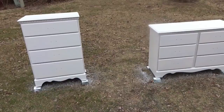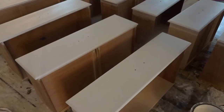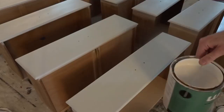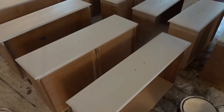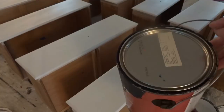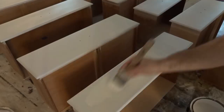Check it out — I got them all spray-primed now. They look way better than they did. I brought everything inside because it looks like it's going to start raining. The drawer faces I'm going to paint just a bright white — El Cheapo stuff from Menards. Even though no color was added, I still had them mix it at the store because I've had white paint turn out terrible when not mixed well. It'll probably take about three coats. Then I'll paint the dresser bodies with this Midnight Azure — a really, really dark blue, pretty cool color. Once everything's painted, I'll throw the handles on and this thing will be good to go.